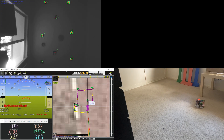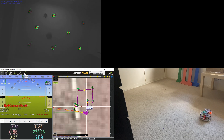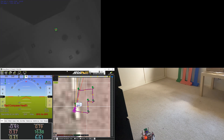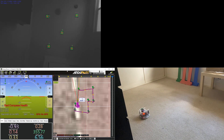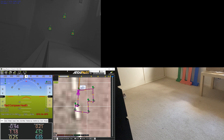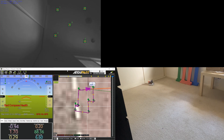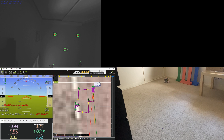Note that for this application, the tags are on the ceiling of the room. Tags on the ceiling were found to work much better than tags on the wall, and it is highly recommended that multiple tags on the ceiling are used. The room must also be well lit so that the camera can easily pick up the tags' position and orientation. In terms of performance, AprilMav running on a Raspberry Pi 4B gives around 6-8 frames per second.